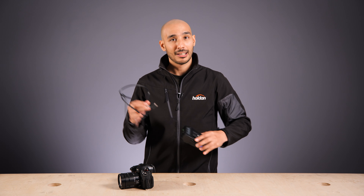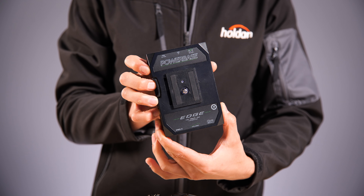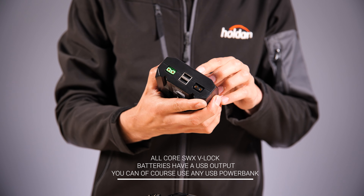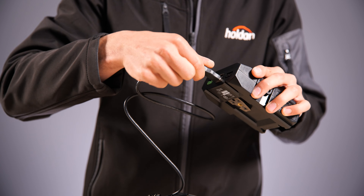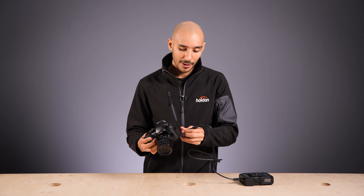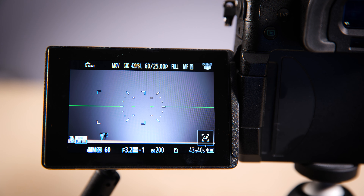If you have V-Lock batteries in your kit bag — or one of these smaller V-Lock batteries like a Power Base Edge by Core — you can carry one in your bag, and when you're not filming, plug a USB cable into the battery, pop the other end into the camera, and have the battery topped up while not shooting. And if you turn the camera on, the camera will actually run off that external battery too. So you've got a camera rig that can run indefinitely, which is perfect for filming events and conferences.